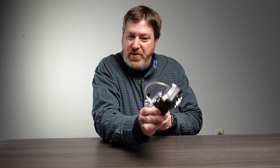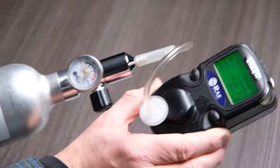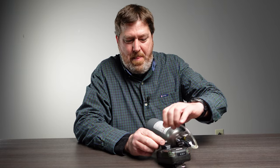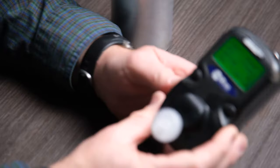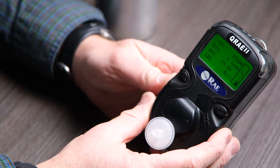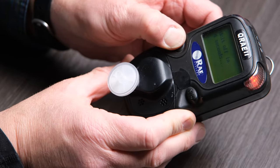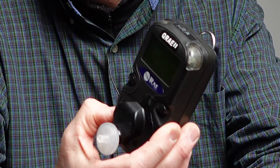So that tells you your meter is calibrated — it's reading right within a close percentage of each value, so you're good to go and you know your meter's reading correctly. Close the valve off. The meter will eventually zero itself back out. Simply turn off the meter by holding the left button continually — it'll be a 5-second countdown, but you have to hold the button down the whole time. Your meter is calibrated.